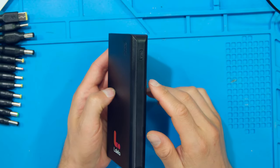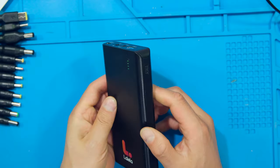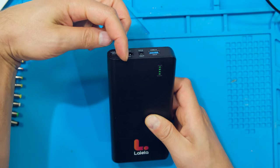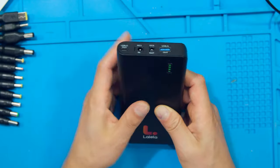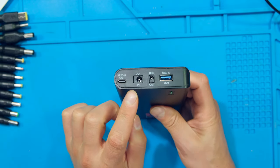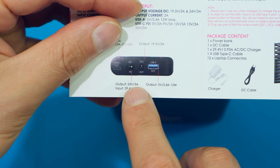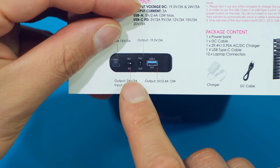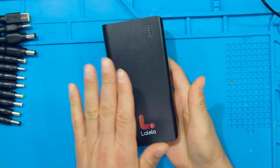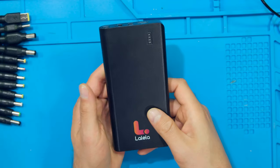Overall I quite like the unit, but something strange is that the power button only works for the USB-A and USB-C outputs. In my mind the power button should be positioned near those two outputs, with some signage, because the two DC outputs in the middle are on irrespective of whether the power button is pressed — so there could be improvement in the logical layout. Another concern is that the DC1 voltage specification says 24 volts at 3 amps, but during my load test I was getting 28 volts, so be aware if plugging into a sensitive device. Overall I quite like the unit — it didn't overheat during any of my tests and stayed relatively cool even while charging. Thanks for watching.